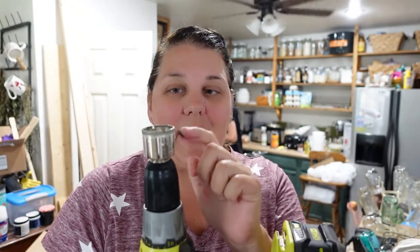Okay, that was mildly scary. What I would recommend is creating a template for the bottom of your sink. Basically, I would cut a piece of wood that fits right into that part of the bowl, and then I would drill a hole straight in the center with a hole saw exactly the size of your drain, exactly the size of your drill bit. And then your drill bit would only have one place to go.